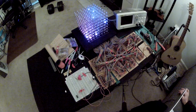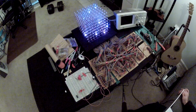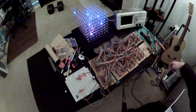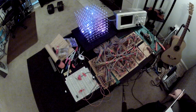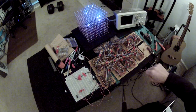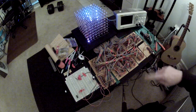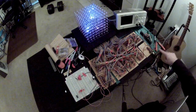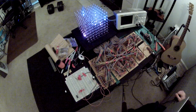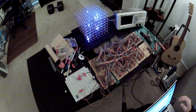A lot of wiring — probably not the most efficient way of doing this, and not great for signal integrity either. In fact, I know it's not good for signal integrity because I've had grounding issues. After I built this thing and turned the power on, nothing happened. I had a dead short between two pins on a shift register, a grounding issue — and I still do have a grounding issue. In fact it won't work unless I'm grounded to the scope, which is kind of funny.